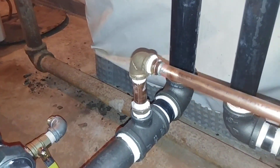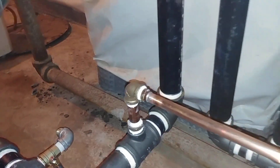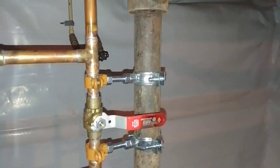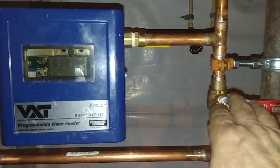That's what we're feeding in the water. We've got a three-quarter by half bushing and a brass nipple. We've got it braced to this dry return. There's our VXT with the manual bypass and the brackets holding it.